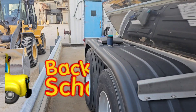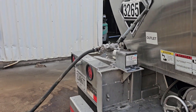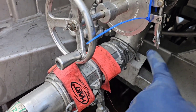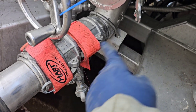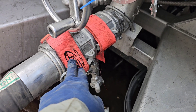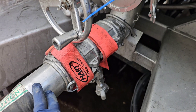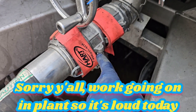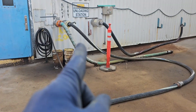Because I try to teach y'all here on my channel. Now, we have that special fitting made. Of course, you can see we got our air. We had to use a double female coupling along with a three inch with a bleed off, then a three inch double female. Because they had a male end on their hose right here. So, you got a male on the trailer, male on here. So, you got to have a double three inch female to connect the two male ends. Plus, you need a bleed off so you can bleed the pressure.